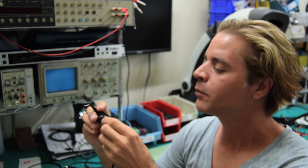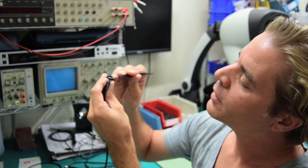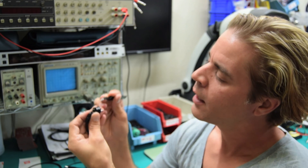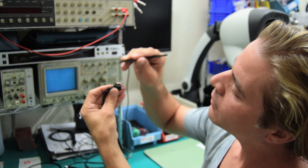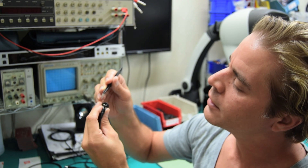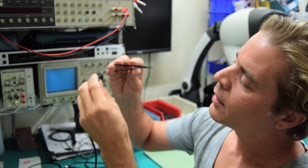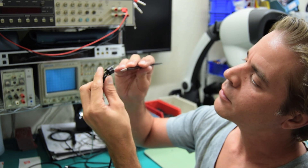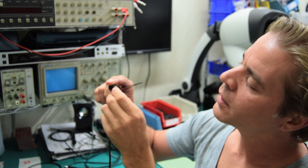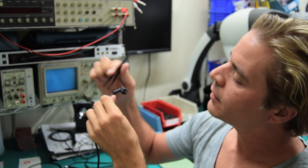You've got three leads on the transistor. The transistor I'm using is a 2N3904. When you look at it, it's curved on one side — the top pin or lead is the collector. That collector goes to the small lead of our Cinch Jones connector. The bottom lead, or emitter, connects to our ground or the large lug of the Cinch Jones. The middle lead we wire and solder to a 10k resistor.